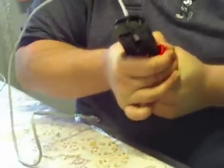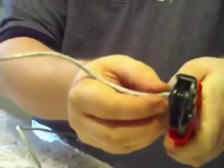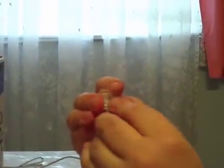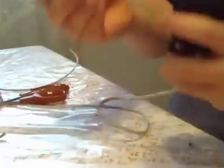And then I'm going to give it a little more pressure — not too much, but enough. You need to give it a good amount of pressure. Make sure it makes good contact, then make sure it's nice and snug in there and try to pull it out. So now you can see we have a crossover — it's normal on one side, and then transmit and receive are crossed over on the other side. And this would be a cable that you could use to connect ports of switches together in a wiring closet if you didn't have an uplink port or a port that canceled the crossover circuit.